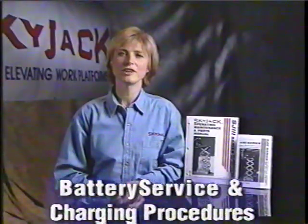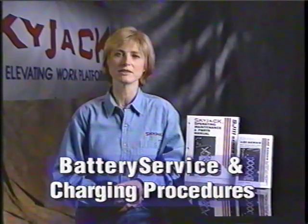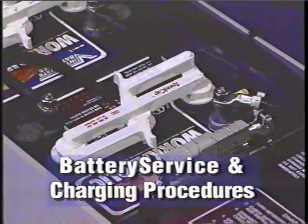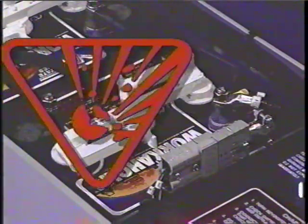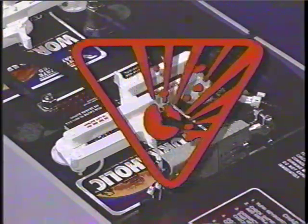This section of our video deals with maintenance of batteries, charging procedures, and the maintenance responsibilities of operators. We will start with some of the dangers of batteries and chargers. Batteries contain electrolytic acid, which may produce flammable gas. Keep flames and sparks away from batteries and do not smoke near them.